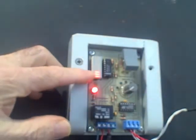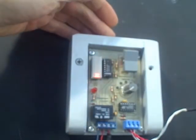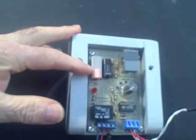We have the switch set on the top position, so you can see the collector temperature. So the collector temperature is about 120 degrees. The storage tank temperature is much lower than that. Actually, it came on even sooner than that. So in order to turn the pump off, we can raise the temperature on the storage. There we go. When the storage tank temperature is hotter than the collector temperature, the pump comes off.